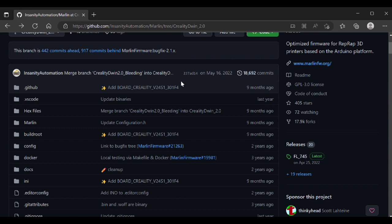Once it became operational I wanted to find some newer firmware, because the firmware that was actually on the machine or that you get from Creality is kind of lacking in a couple of ways. Notably it does not have manual mesh and it does not have automatic PID tuning, which are two things I really like to have. So I set out looking for alternatives to the Marlin firmware, and you're really limited in what you can get because of the touch screen that's on it.